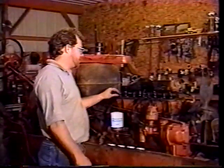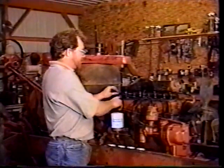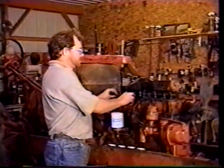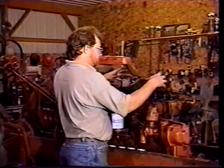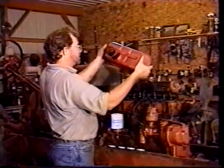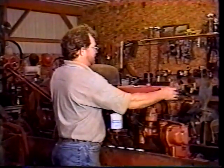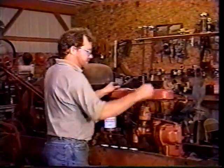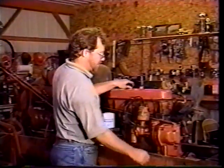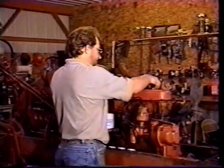We're gonna put the valve cover on, and we've got a new gasket here that we'll put on. We put some contact type cement for gaskets on this to keep it in place. Sometimes these are bowed and they don't hold together well. So then we'll get the valve cover. We've cleaned it up, cleaned all the oil out of it, and put that on there. And then there's little O-rings and nuts that go on here. We'll have to get those O-rings. I don't have those right now, but put those on.